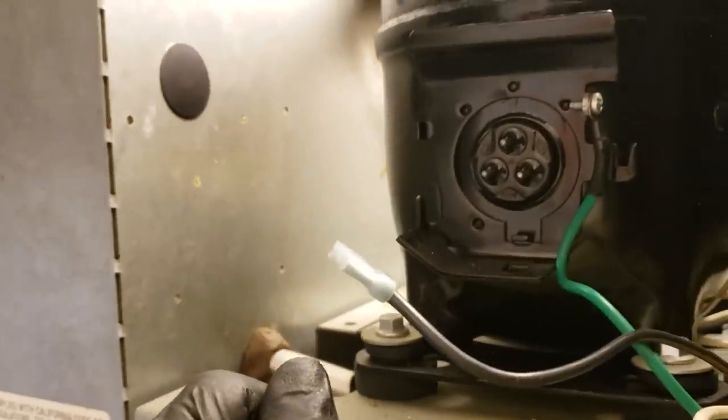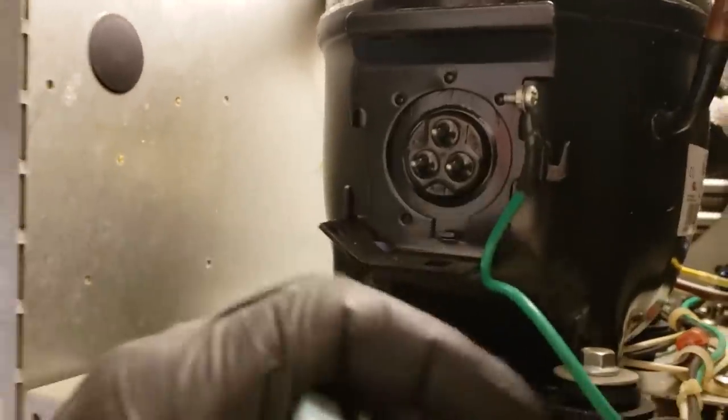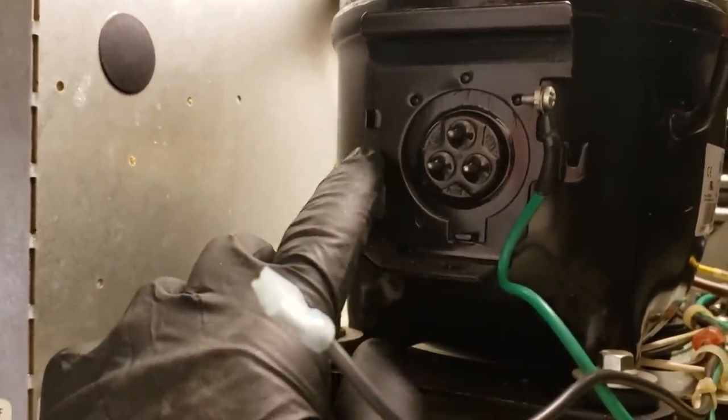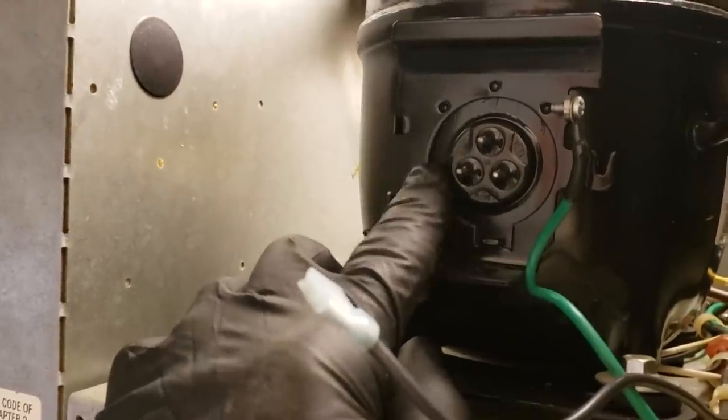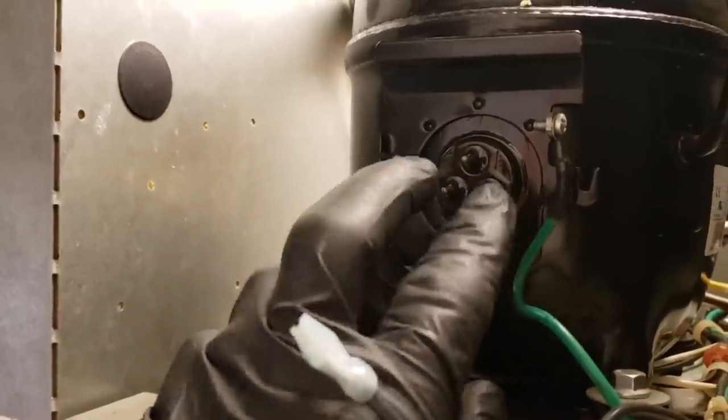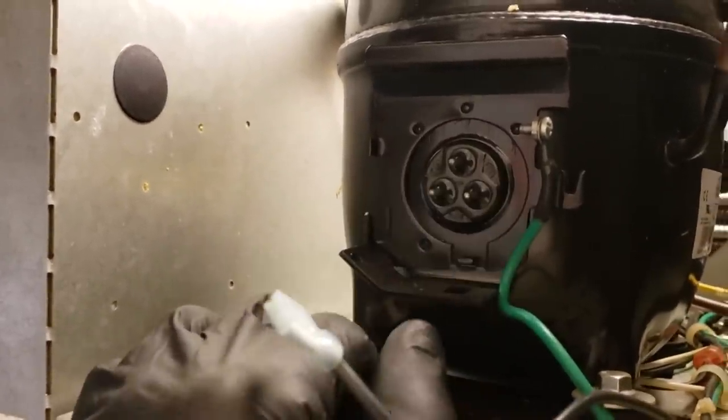A compressor analyzer can be big and cumbersome — that 3-in-1 is cheap and small. Throw it on, jump it. So we're just going to wire it in real quick and then fire this guy up. I tested these posts right now and they all ohm out to be pretty decent. Two of them add up to the third one pretty much.